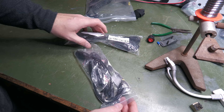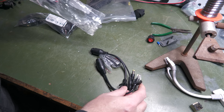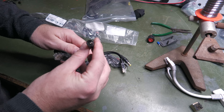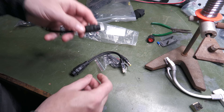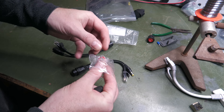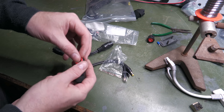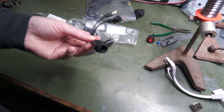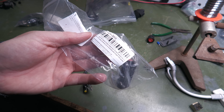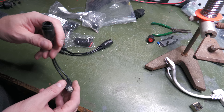Instead we can have a look at the ones I got to replace it. It's like a set — the idea is that you can have an injector on each side of an RJ45 connector: you put power in on one side and get the power out on the other side. These are water tight — it comes with rubber O-rings and gaskets. I'm hoping to make the next one water tight so I don't get water in it. It says 'two-piece POE injector splitter waterproof.'